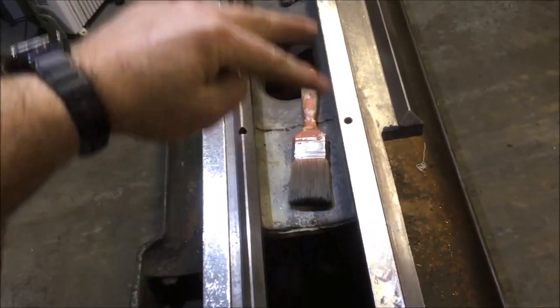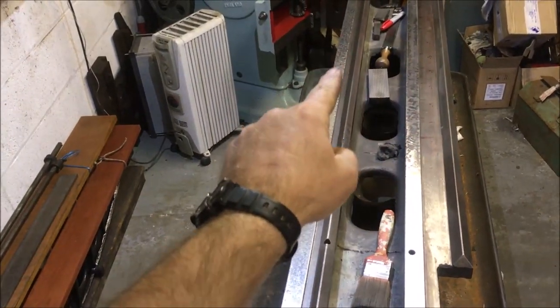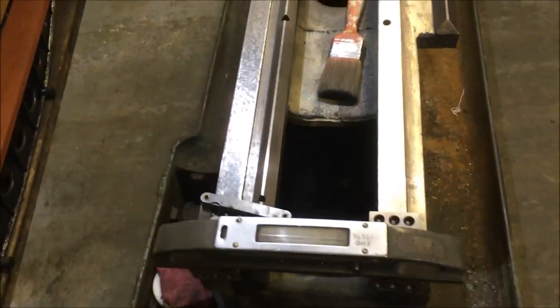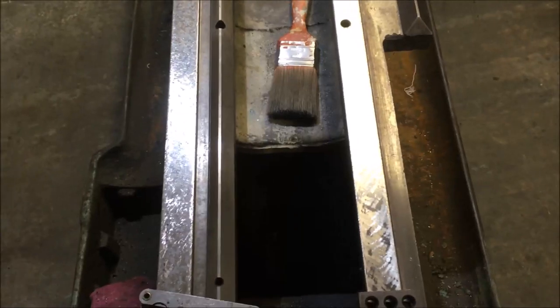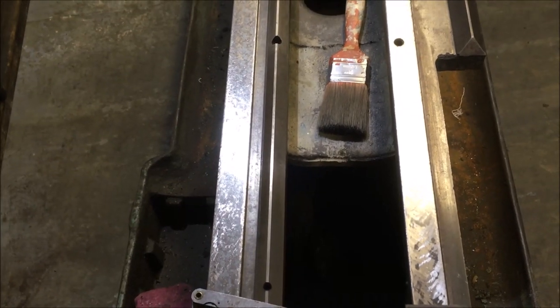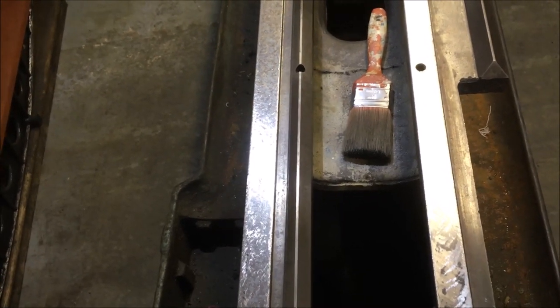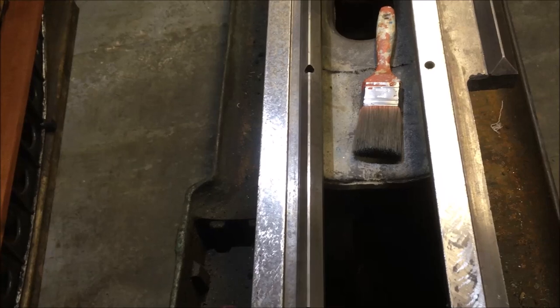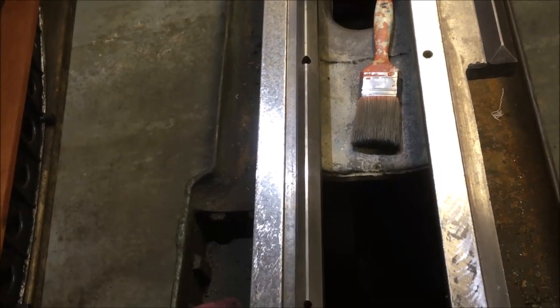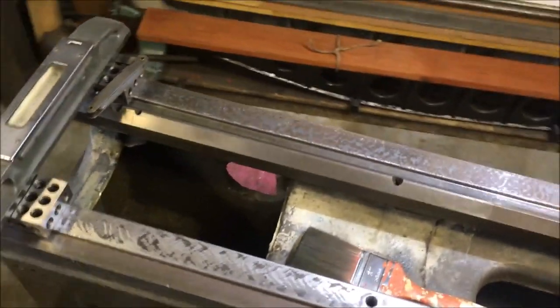And then obviously if I wanted to take intermediate positions, because what I'm trying to do is get this way coplanar with that way. I'm about just under half a thou out. I think that ends high, but I need to check it again. But it was just a bit of waffle to sort of explain my understanding of it. It's probably a long way short of where it should be, but as far as I'm concerned, I'd rather have a consistently wrong measurement and be comparing it with another consistently wrong measurement, as long as the error is going to be the same because of the consistent approach. I'm prepared to be shot down, but there you go. I've not got to make this fit anybody else's. It's only got to fit itself.